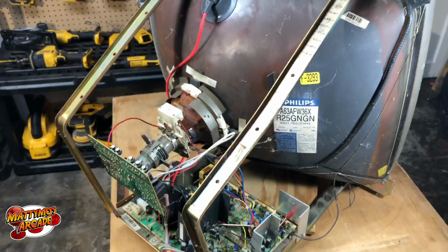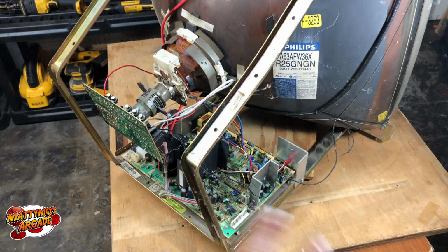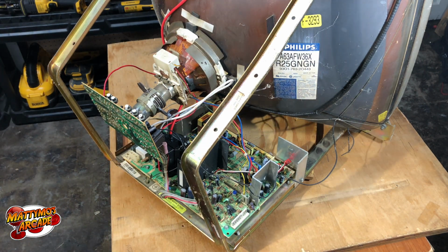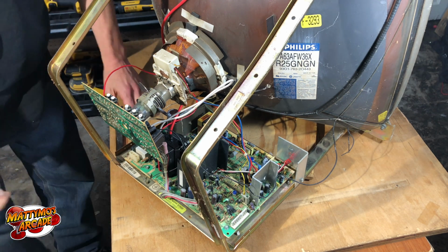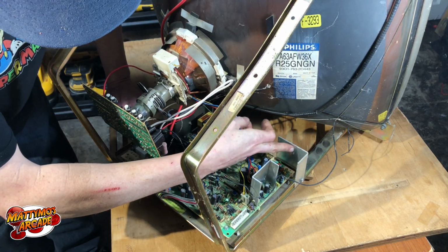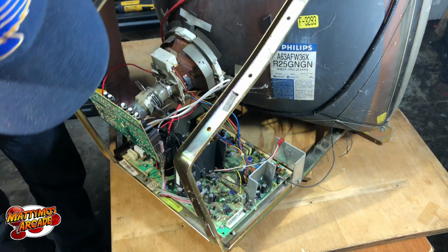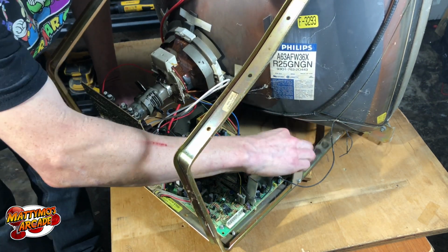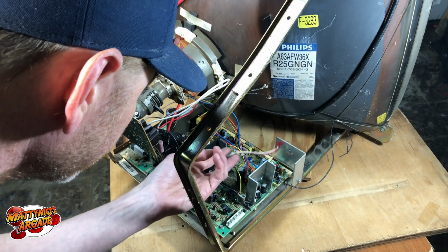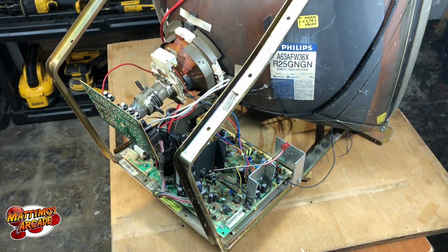So this one's a medium res monitor. It's for a Golden Tee, which I do believe the year that he has, you can switch back and forth. Another good way to tell if this is a 7500 or a 7400, 7400 is standard resolution, is this right here is going to be coming off, and usually there is a transistor that's right there on that little back part, heat sink or whatever it is there. Okay, I'm just making sure. Let's make sure this really is a 7500. Well, it is, because it has this. Whether or not that and the tube are is another story. But we're going to go through.